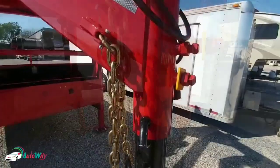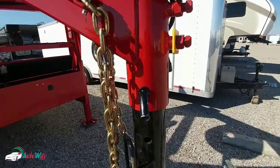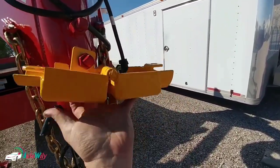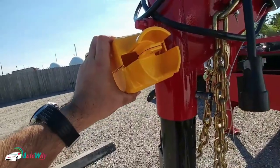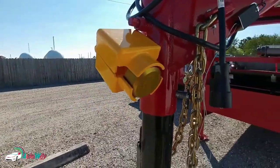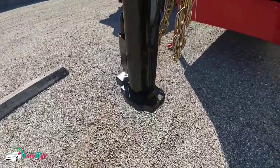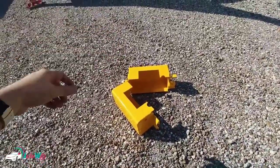Torque this back down, and once it's torqued you're going to reposition right here. Then simply take the smaller of the two locks and cover it up — put it right here and close it up like that. As you can see, you no longer have access to that bolt. It surrounds that area completely, so you won't be able to take that set screw out and you won't be able to pull the sleeve out from this portion of it.